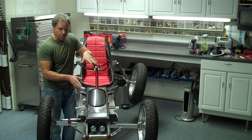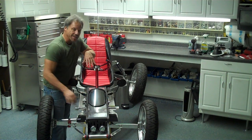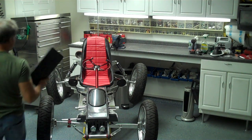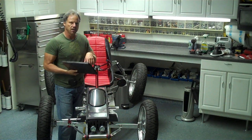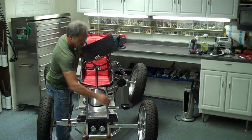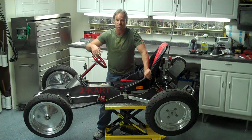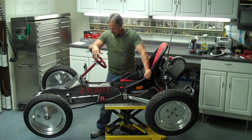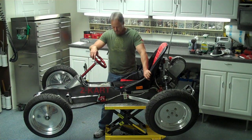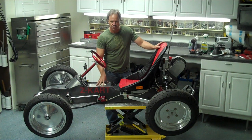This is the accelerator over here — it's not a gas pedal because there's no gas, but it does accelerate the vehicle so I call it an accelerator. I added mirrors as well. The body on this I made out of plastic — I bought a four-by-eight sheet of three-quarter inch polyethylene plastic. I wanted two halves that go together with the batteries and everything in the center. It's one big sheet of plastic, and I also used aluminum paneling on the inside with some aluminum angle to secure and strengthen it. Plastic is recyclable too.